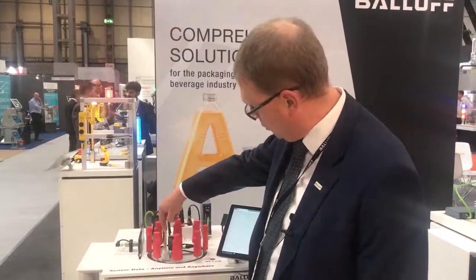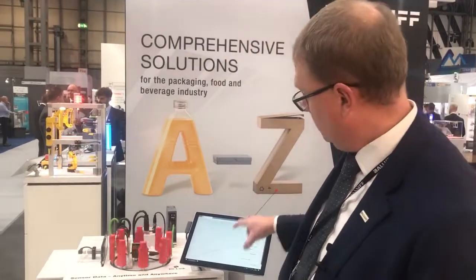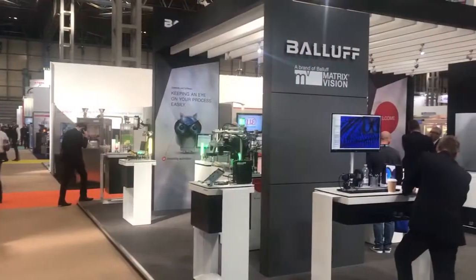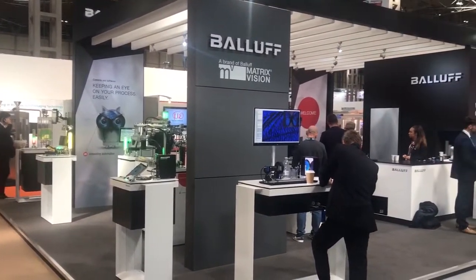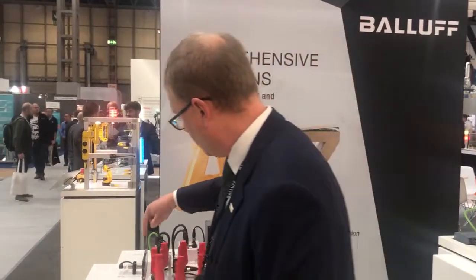This little slide on the front here is actually imitating a dirty lens. When I move it over, you can see the gain on the HMI moves up, indicating that we've got a dirty lens. We can set a threshold and send a text message, an email, or sound an alarm to the maintenance team.